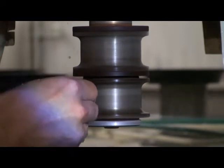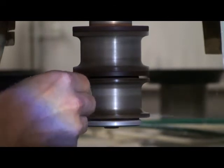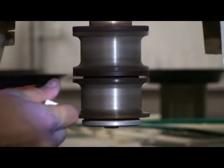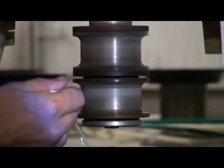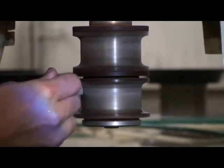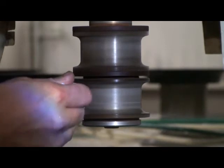The first visual indication will be a color change. The color change represents a new layer of bond that's being reached. The objective is to tear away the bond at an even rate and create a nice smooth surface while exposing new diamonds.